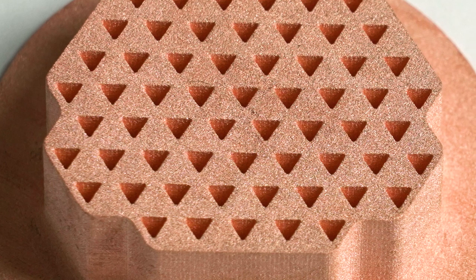Usually the lack of porosity is the bragging point of metal additive processes — we talk about how dense they are. But the microscopic porosity here is good porosity; it's the characteristic they were looking for. This is not a fully dense metal part, but that doesn't mean it's a faulty part. It's porous by design — controlled porosity.